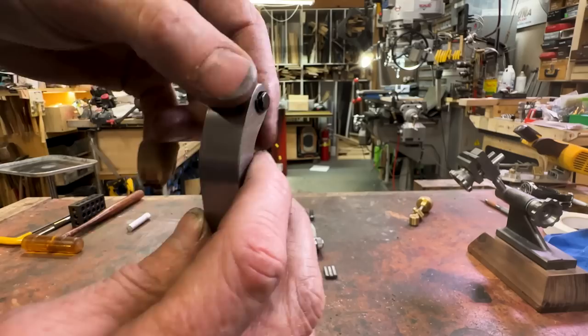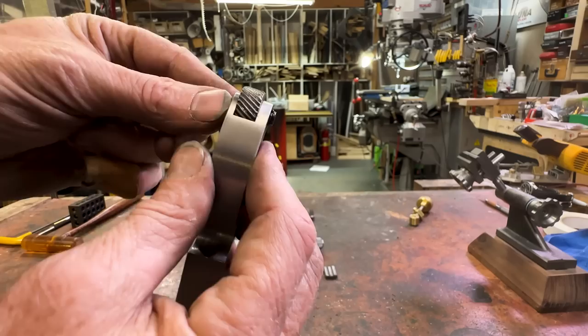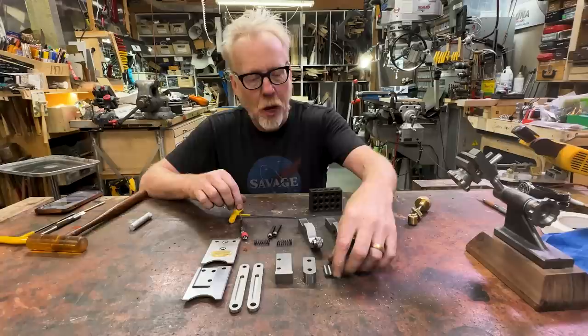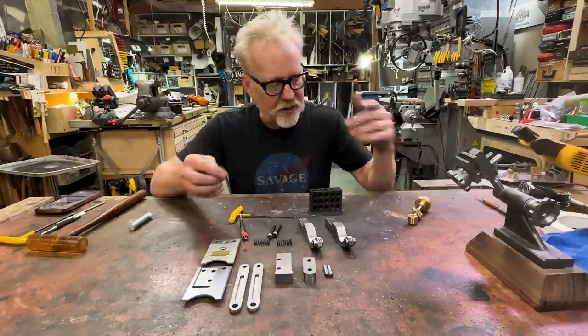All the force is going this way, so I'm not worried about that shearing off. That can handle a huge amount of force. I'm also not worried about how small this arm is. Given how cheapo the clamp knurler I used on the lightsaber was, I feel like this is plenty of meat. This entire thing is held together with two screws and 3 dowel pins. A dowel pin is a piece of semi-hardened steel with chamfered edges. These come in standard lengths. They come in all sorts of standard diameters, metric and imperial. And it's great to have a complement of them in your shop.